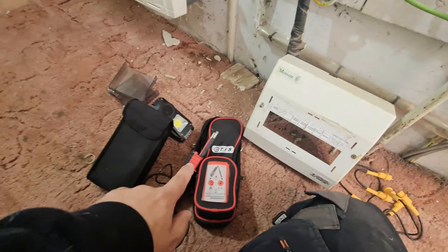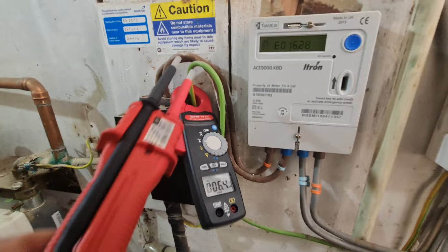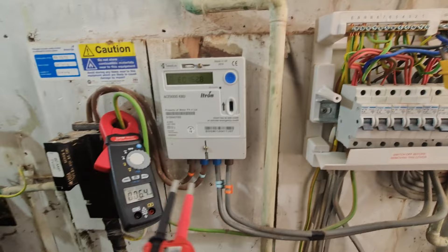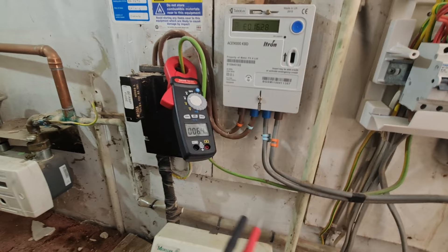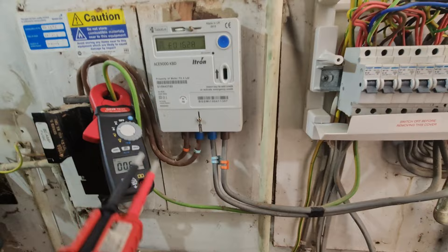I've got my voltage indicator set up with some lights. I've popped the earth leakage clamp onto the earth - but not around the line and neutral in this case, because I'm not really looking at leakage current within my installation as it's isolated in essence. I'm looking at what may be coming through the earthing system externally. While this is a supposedly TNS system, we need to remember to assume it could well be TNC-S in the wider network. If there is an issue out there, we could start importing some currents into our installation while I'm working on it. So I've got that set to monitor.